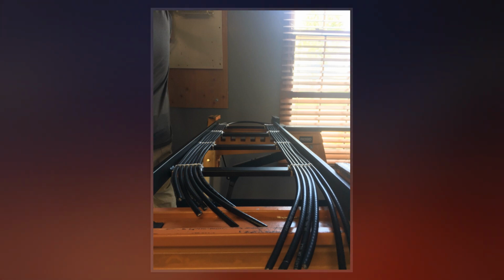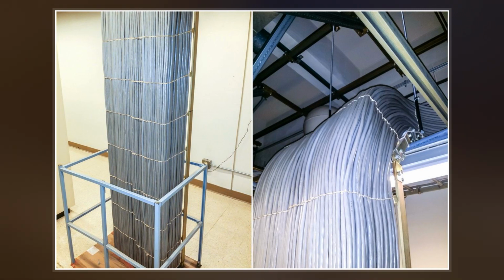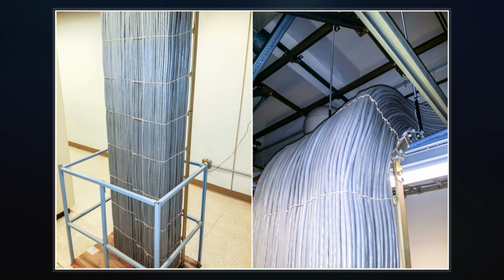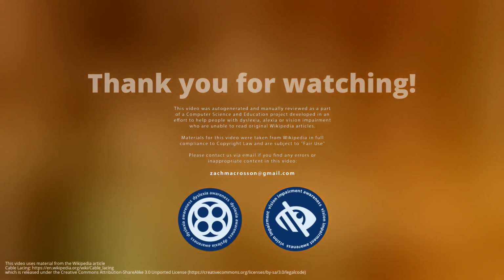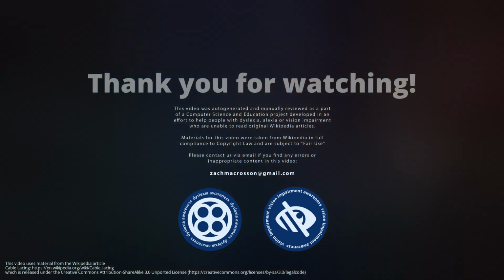The lacing begins and ends with a whipping or other knot to secure the free ends. Wraps are spaced relative to the overall harness diameter to maintain the wiring in a tight, neat bundle, and the ends are then neatly trimmed. In addition to continuous or running lacing, there are a variety of lacing patterns used in different circumstances.